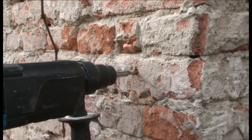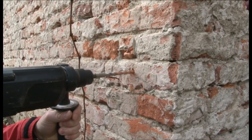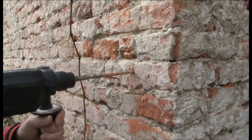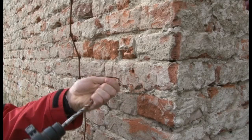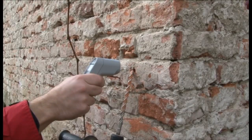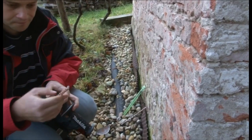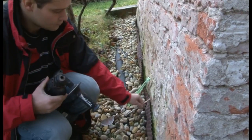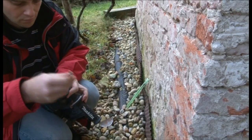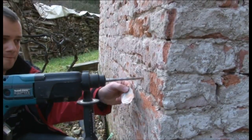For this purpose, drill dust is taken from the wall at a depth of at least 10 cm with a slowly turning drill. The hand warmth test shows that the drill is not warmer than the temperature of the hand. The drill tip stays below 40 degrees, measured with a contact-free thermometer. When the temperature is exceeded, the drill for removing the dust is changed, ensuring the required accuracy of measurements.